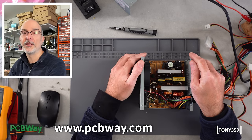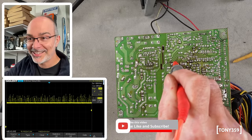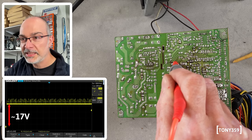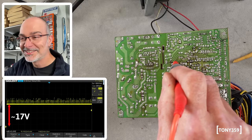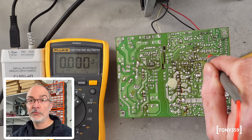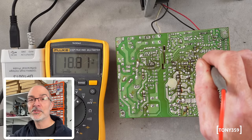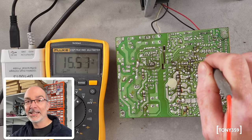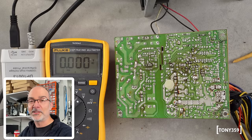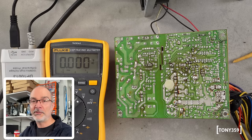Now let's go back to the power supply and see if we can make it work. With the capacitors replaced, let's see if we get any difference. Yes, look at that — it's gotten much better! This is 5V per division, so it's reading like 17 volts — amazing! Maybe we got it. Let's try to power up and see what the multimeter reads on pin 12. We got 19 volts, which is great! I was looking for 12 volts and we got 19 — fantastic! I've got the multimeter connected to the 12 volt output. I'm a bit concerned because there's still a swollen capacitor. I'll give it a quick go and see if we have any activity, then switch it off and replace all the capacitors.